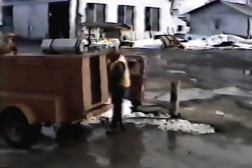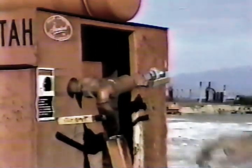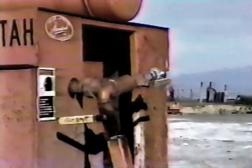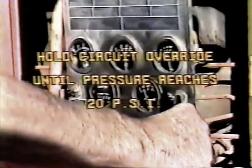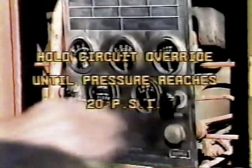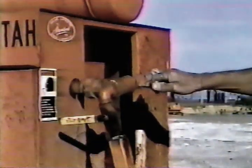That's it for daily checks. Now, start up. The first step in starting is to open one of the two air valves on the front of the compressor — that keeps air pressure from building up in the system and makes it easier to start the engine. Flip the starter switch and push down both the starter button and the circuit override button at the same time. As soon as the engine starts, release the starter button, but hold down the circuit override until the air pressure reaches 20 psi. Then close the air valve.